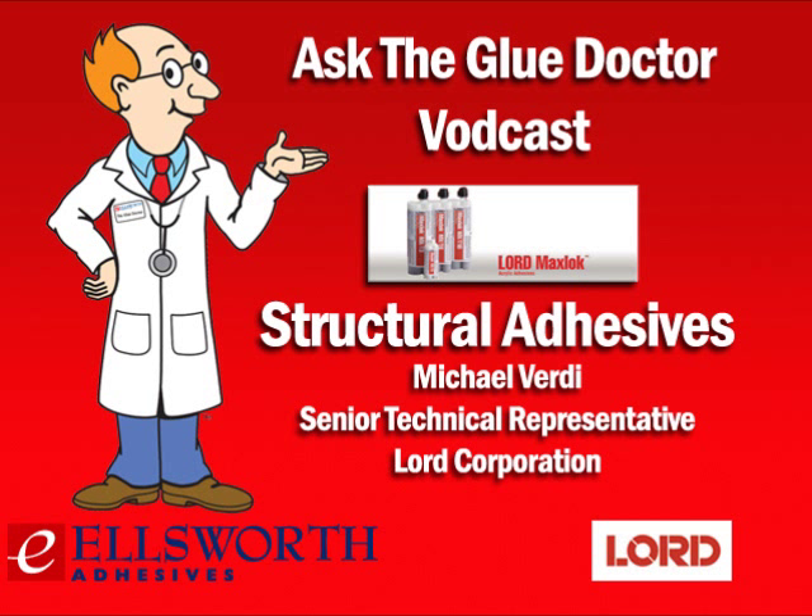Can you tell me what are some of the properties associated with metal bonding structural adhesives? Most metal bonding adhesives tend to have very good high strength and are chemically stable up to 250 degrees Fahrenheit, with some instances where they'll withstand up to 400 degrees Fahrenheit. They tend to be impervious to different kinds of harsh chemical exposures, whether it be gasoline or any type of acids. These adhesives are easily dispensed, and implementing a metal bonding adhesive into a customer's process is often a drop-in type scenario. The Lord MaxLock family incorporates different ranges of curing speeds, ranging from slow to fast, without having an effect on the actual final cure properties, allowing a customer to utilize just one adhesive to fit several different applications.